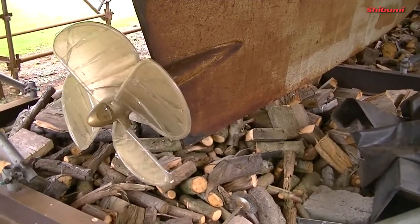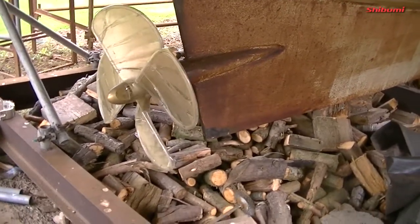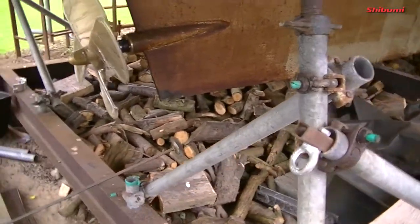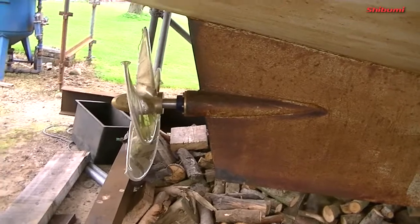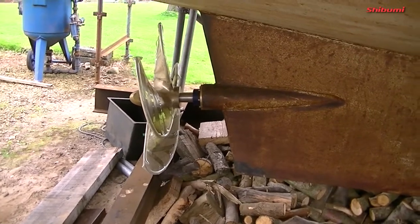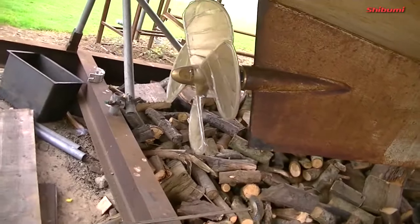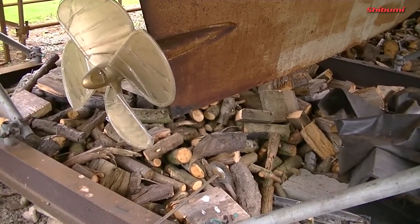That will remain dry — we'll actually be putting probably a drop of oil down in there. The stern tube is in its own enclosure, a fibreglass enclosure — it's a completely sealed system. It's made by Aquadrive, and it's a wet bearing, which means that ahead of just where it comes through the other side of the bulkhead inside, there will be a water injection point from the engine that will feed water down into that shaft.